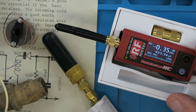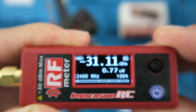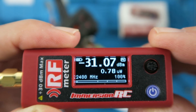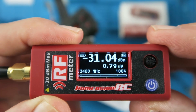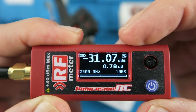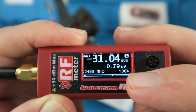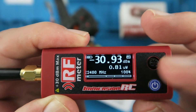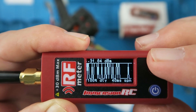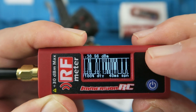Let's take a closer look at the operation of this device in its usual environment. Turning the unit on, we get to the main screen which shows us at the top left the indicated battery — this should run for around eight hours on a charge — the dBm reading, the indicator for either peak or average measurement, and below we have the milliwatts or microwatts, the frequency, the duty cycle, and an analogue type display running along the bottom. If we go to the right we get to the oscilloscope-like function, and we can see at the bottom an indication of duty cycle and we can change the span.